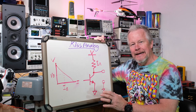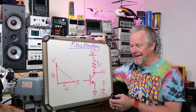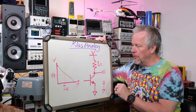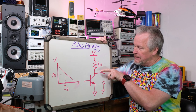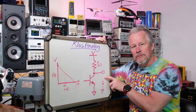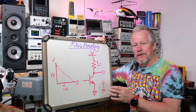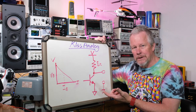I've got a simple schematic here. The output would go to our speaker — in this case we'll put an 8-ohm load there. We want to swing the voltage up and down. With a single voltage rail we place the bias in the middle. Let's say it's a speaker and we're going to put 8 watts into it: I²R, so 1 amp into 8 ohms gives us 8 watts.